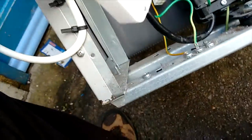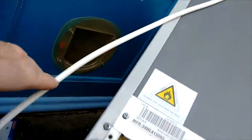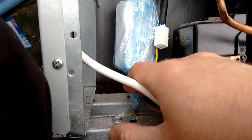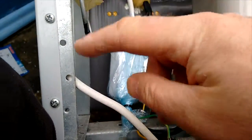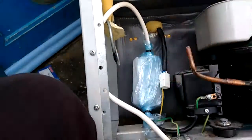Both these ends are secured now so they can't pull out. What I'm going to do is push this into the back of the system here, and I'm going to improve some of these junctions here so no water can actually get in there - elevating it so any water coming down here would drip off. I've slipped a freezer bag over the top here and cable clipped on both sides so that's completely watertight now.